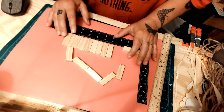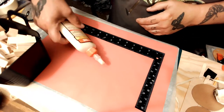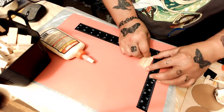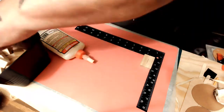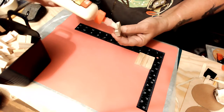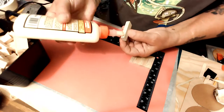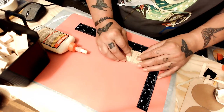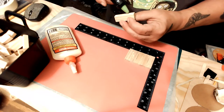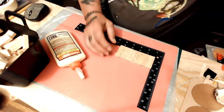Thank you for watching — I really appreciate you. Alright, let's jump right into it. I'm using my Titebond glue, original wood glue — this is actually very old but it's still one of the best glues I've used — and also hot glue. I put the Titebond on the edges and hot glue in the center, and as you're gluing these together you want to flip them back and forth. I may not have done that enough because my mind gets distracted by the music that's playing.